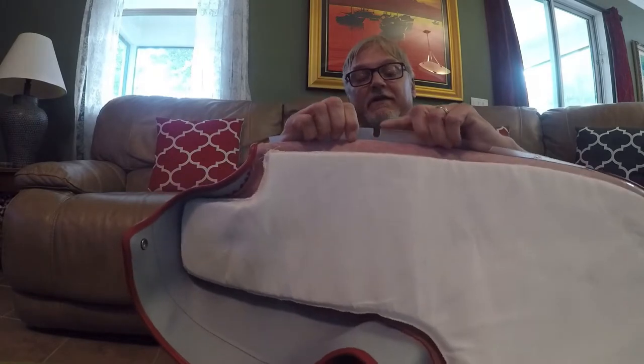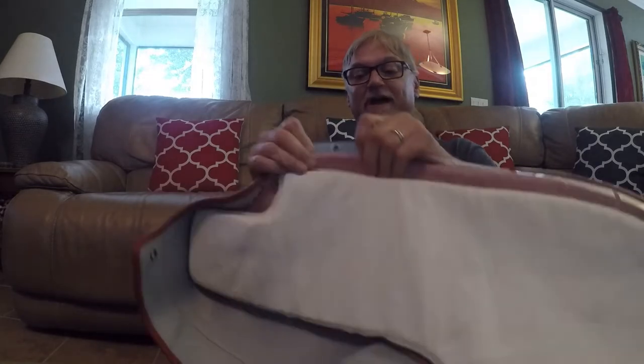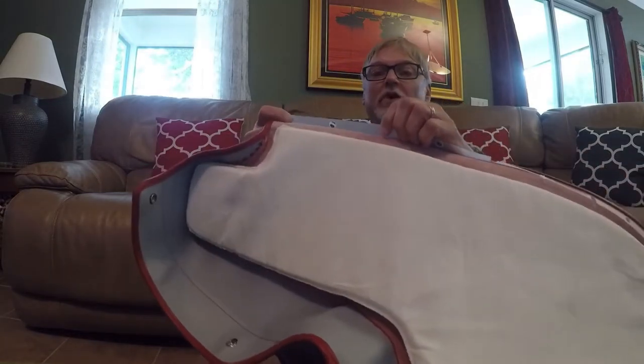The boot clip I have installed comes with U-shaped holes in it, but that is not what you want to use. You actually want to drill a hole that matches the back side of these two brackets that stick out. Find a drill bit in your arsenal that matches — that's what I did. I drilled a hole halfway between those other slots, drilling out all 16 holes.